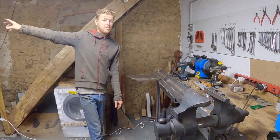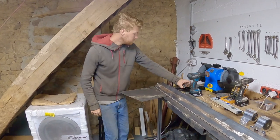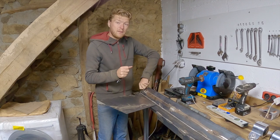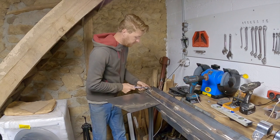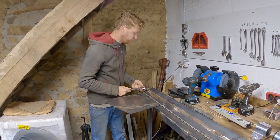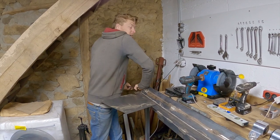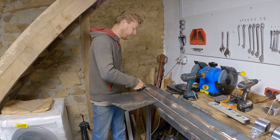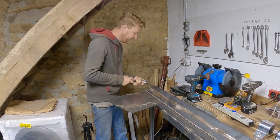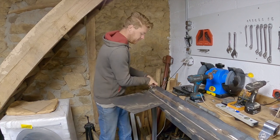I've had to mock up the other side because on the original floor pan, it's so badly damaged that the bend is completely indistinguishable — completely bent over and shot. This will be the driver's side, and from that I'll make the passenger's side. Half the trouble with this car is that because of the accident damage, all my dimensions are completely out of whack. On top of that, I've got Honda rear suspension with no Honda to measure, and MX-5 front suspension with no MX-5 to measure. If I'd started with a parts car I'd have all my measurements, but it's like building a car in fresh air — which is why I don't have a big jig.